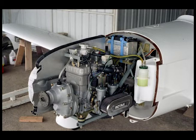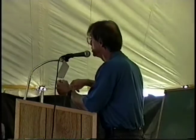The second engine we put in was the 582, and it also stopped after 35 hours, and it stopped because I pulled a little ferrule that was soldered on the end of one of the throttle cables off when I pulled full throttle, and it ingested it, went into the rotary valve and tore the engine up. So my feeling about the two strokes, specifically the Rotax, is that they're reliable engines, but the auxiliary stuff, the hookups and so forth, fail. And it's not Rotax's fault. I think we don't know how to install the engines yet. So I'm getting smarter about it. I've figured out how to not have the ferrules come off the end of the throttle cables. But if I have to do this learning curve for every one of these failures, it's going to be a long time before I have a reliable airplane. But 35 hours, trouble-free, aside from that little problem.